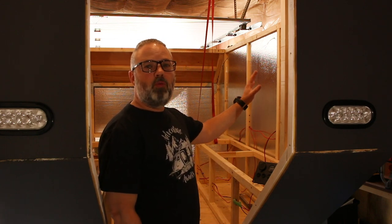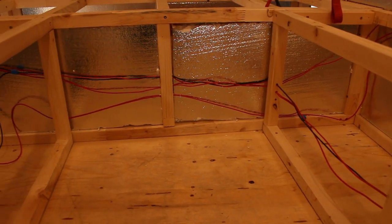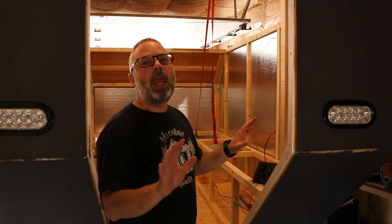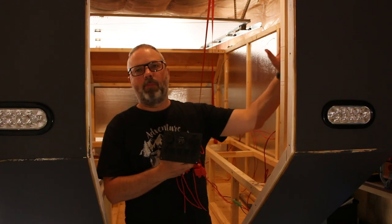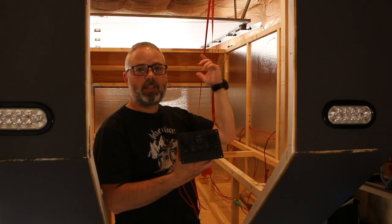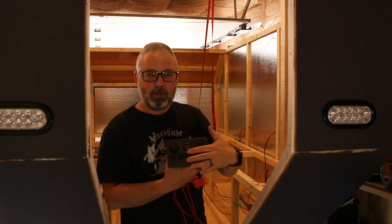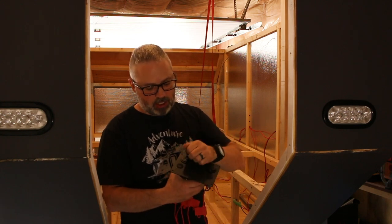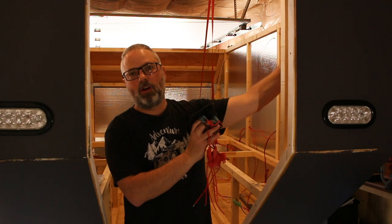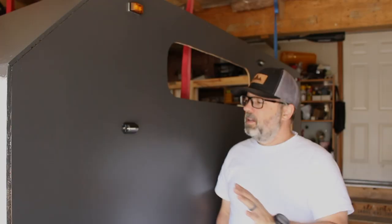As you can see all the way along here, I've chosen a two-by-two wooden stud system. The reason is we can drill holes through the studs and run all of our wiring tucked away so when I enclose everything you won't see any exposed wires anywhere. On the back here is where I'm going to manage all of my lights - three sets of LED light strips on the interior - plus exterior working lights. I'll be able to monitor the battery, charge a couple of devices, and use a 12-volt plug, all mounted right back here.